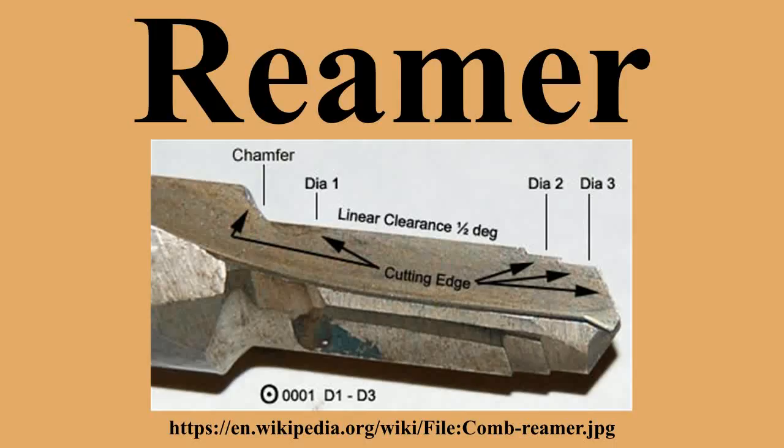A typical reamer consists of a set of parallel straight to helical cutting edges along the length of a cylindrical body. Each cutting edge is ground at a slight angle and with a slight undercut below the cutting edge. Reamers must combine both hardness in the cutting edges, for long life, and toughness, so that the tool does not fail under the normal forces of use. They should only be used to remove small amounts of material. This ensures a long life from the reamer and a superior finish to the hole. The spiral may be clockwise or counterclockwise depending on usage. For example, a tapered hand reamer with a clockwise spiral will tend to self-feed as it is used, possibly leading to a wedging action and consequent breakage.